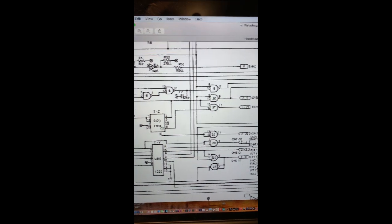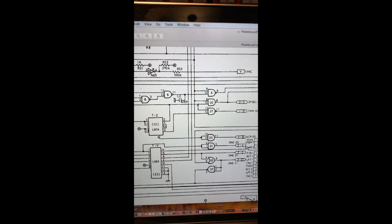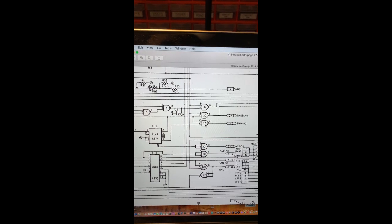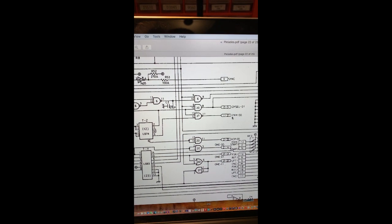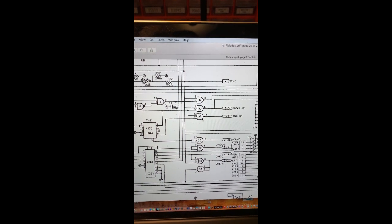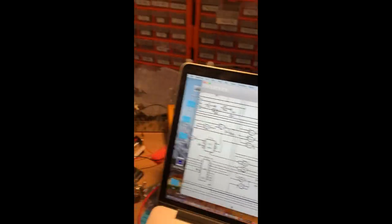and we have these two signals coming up out of this LS74, and one comes along here into pin 13 and comes out of 9 here into pin 12 of 37, which is a NAND gate, and it creates this signal here in H. I'm presuming that stands for horizontal 0 0. So let's have a look on the oscilloscope at 12 and 13 and 11.